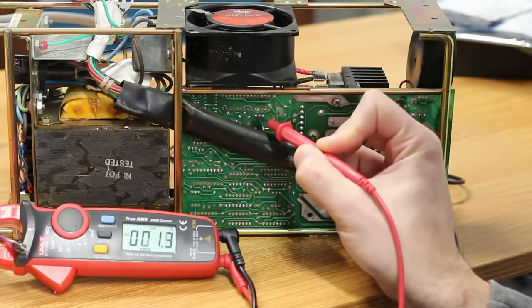Digging through the manual, it seems the memory card has a huge number of configurable settings. At the very last page of the installation guide there's a page that says 'General Jumpers.' Looking through it, jumper 2 to Y out is a 22-bit machine, in is an 18-bit machine — and those two jumpers right here are not connected. Unfortunately these are wire-wrap jumpers, so I need to wire-wrap 2 to Y. I don't have a wire-wrap tool, so I just soldered a little jumper that sits over the posts — I had to shave it down a little to make sure it cleared, but it does clear. Let's hit restart.